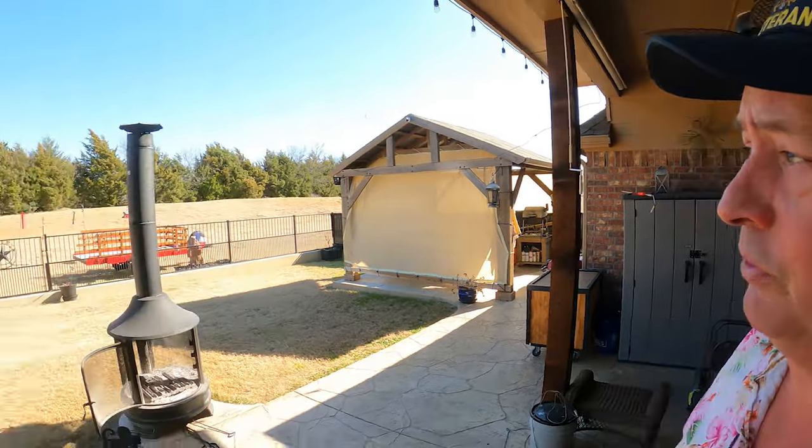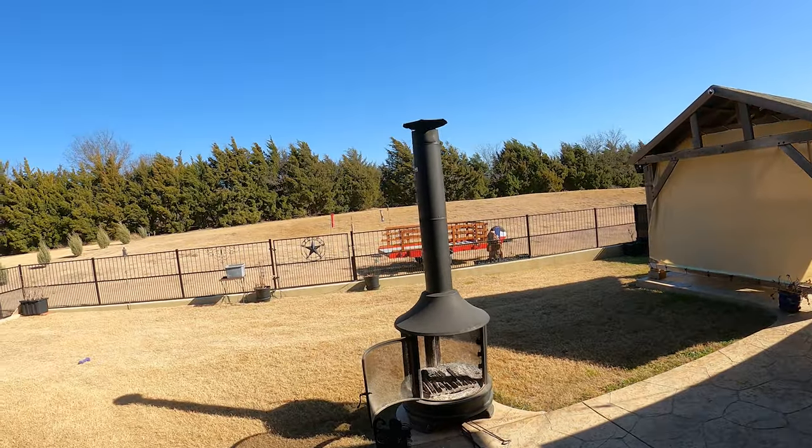Lines, blowing out the water lines on the RV with an air compressor. Pretty simple, pretty straightforward. I lost my closing footage, so I'm back at RV home base. Cold front is imminent. You can see the trees blowing. Of course, you probably can't see them. Wind is blowing pretty hard. Anyway, it's gonna get cold tonight. I'm glad I took care of blowing out the lines on the RV so I don't have to be laying in bed worrying about broken, frozen pipes in the motorhome, because I'm gonna be using it next weekend.